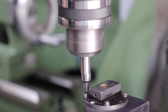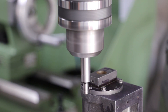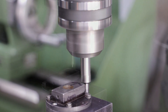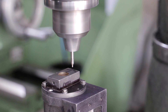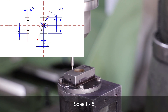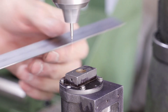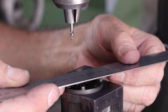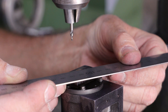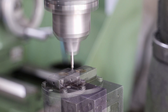For the gland bolts, Don suggests that these be spotted through from the gland itself, no doubt to fit the PCD of the holes that will be drilled into the gland, but also to ensure that they clear the slide rod bolt holes. As I've yet to make the gland and don't have any material available, I turn to my CAD to come up with the requisite dimensions. With these known it becomes a simple job of finding the center of the cover and drilling and tapping the holes accordingly, though I do a quick check by marking both holes lightly and verifying with a ruler.